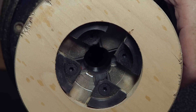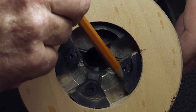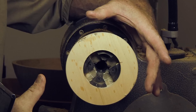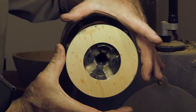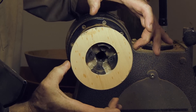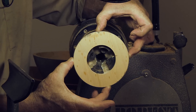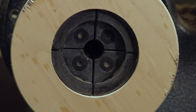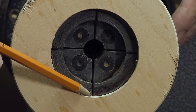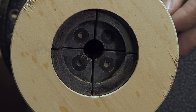This is an example of a not very good fit — there's a big gap right here, which means about the only place the metal is actually touching the wood is right at the corners. The difference is if your jaws fit really well, you're grabbing broadly across the recess. With a poor fit you're grabbing more at just the edges. You just have way more contact — a way more secure grip — with a tight fit. This close-up shows an example of a good tight fit: there's almost no gap, very small gap, so you have lots of metal in contact with the wood.